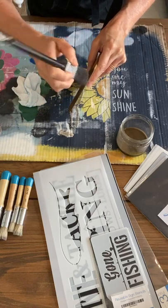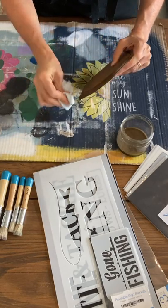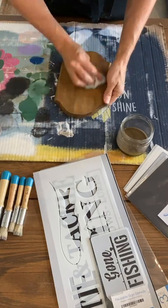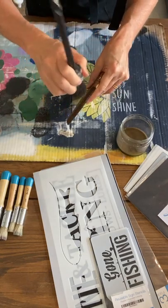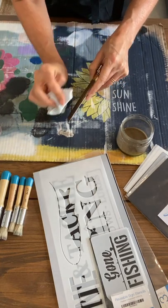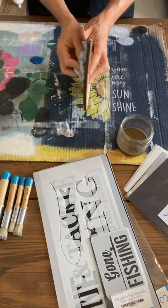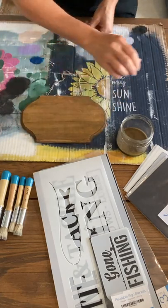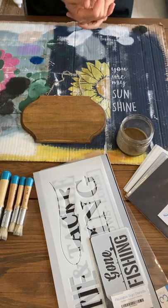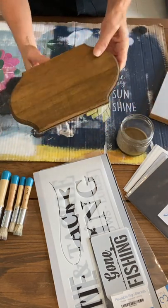I can see little bits where I've missed, and this is the end grain, which always turns out a little bit darker. I was going to mention the need for sealing milk paint — if you're using milk paint as paint on furniture, it will need a sealer; otherwise it is quite a porous finish, similar to chalk paint where you add a wax or sealer at the end.